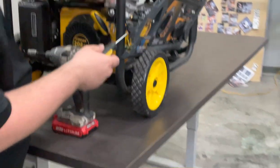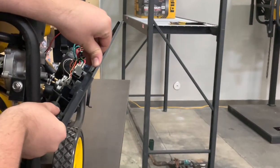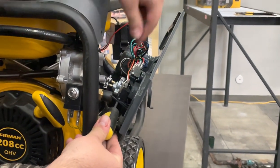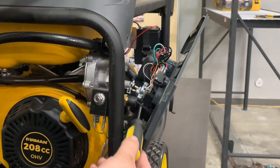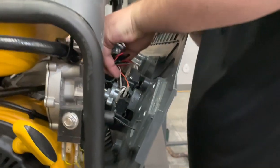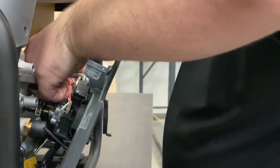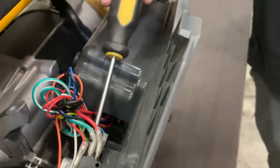If you ever need to swap micro switch one, you come in from the side here — the screw is located right here. It's the exact same process: take the screw out and swap the red and white wires. Those ones are a lot easier because there are only two. The third one on top — move these wires out of the way — is located right here, and the screw to replace it with is right there.